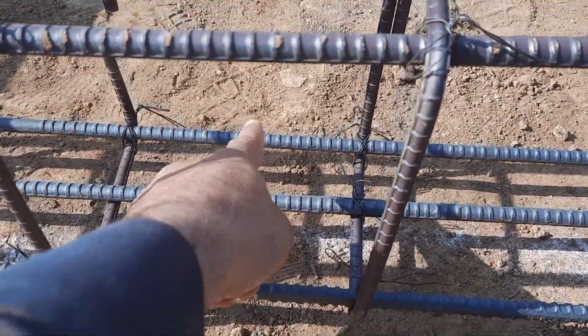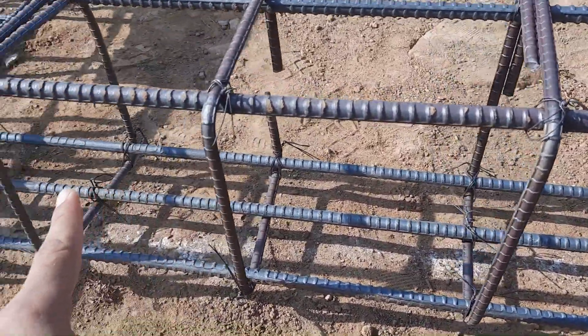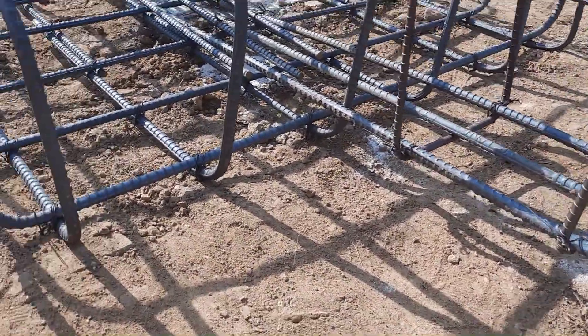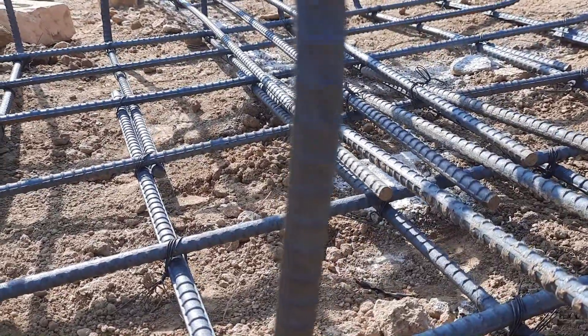You can see we have totally five steel rods — three at the bottom and two at the top — with a diameter of 12mm. Stirrup hooks are provided at 90 degrees, but they should be provided at 135 degrees, so they made a mistake in this place. Hook length should be up to 3 inches.